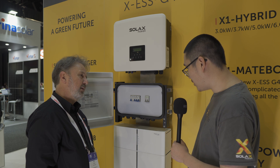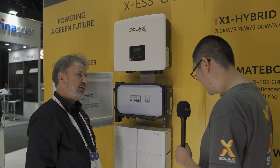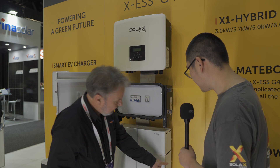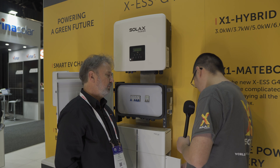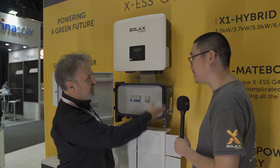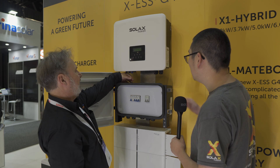Can we add more if we want to? Yes. If the customer wants more, we can add up to four units in total. So we would put another two beside this unit. Now I noticed there's a little hatch on the side here — what's this about? This is just for cable connections. So all your cable management is hidden — there are no wires down the wall, no conduits. You can see your PV coming in here, but it'd be hidden behind the cover.